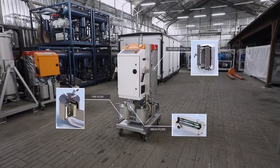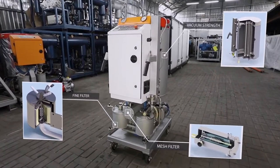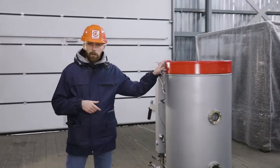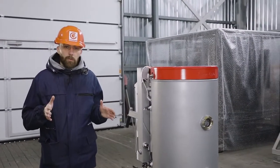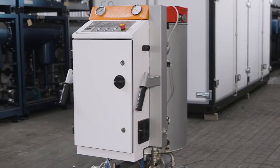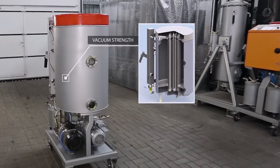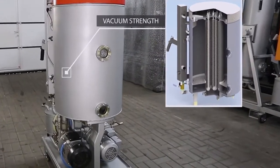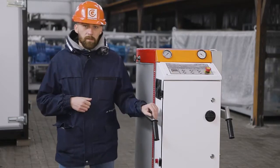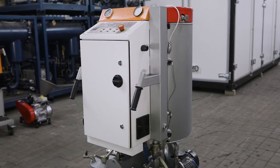You probably have a question: how did they manage to do it? The answer is design solutions and long-term experience of the company. The first solution is a combination of a vacuum tank and a heater, which reduces the unit dimensions and diminishes heat losses while heating the oil. The second solution is to eliminate the input pump — the oil enters the vacuum column by means of thinning insured by the vacuum system. A new layout has been applied to the rest of the unit components, and all of these innovations have resulted in a small equipment size.